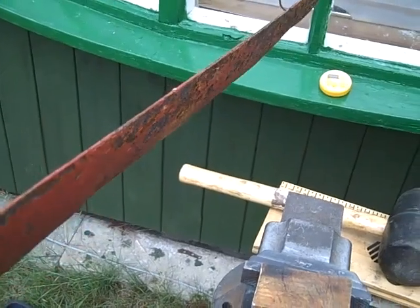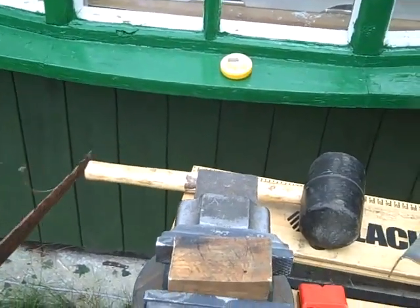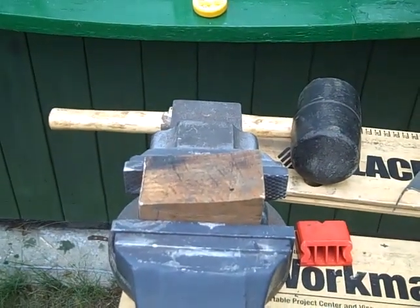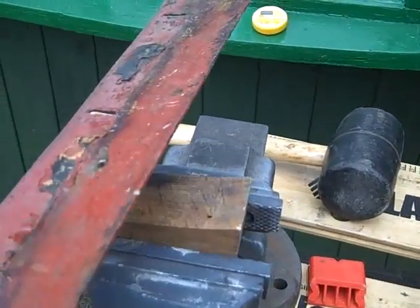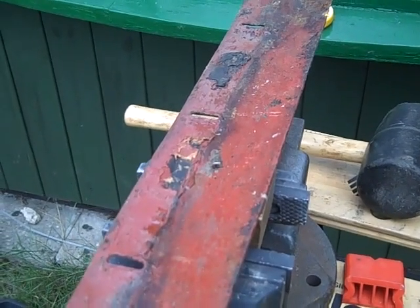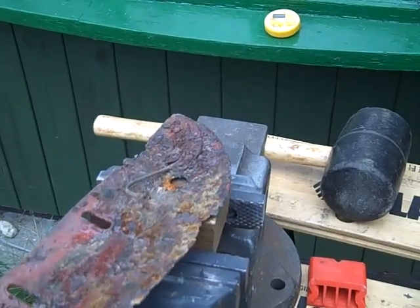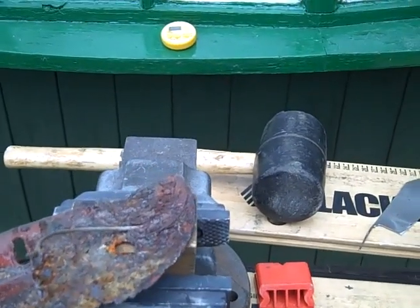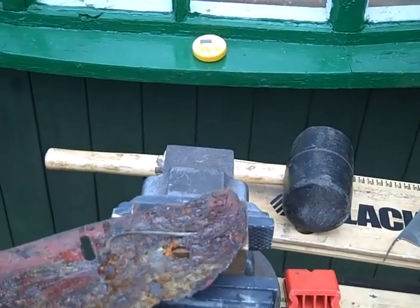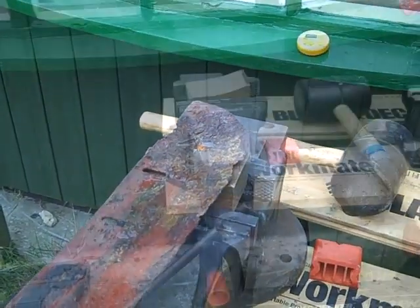To make the curve that we've got on this piece onto the new flat piece, we've got a bit of oak that we're going to shape into the same profile, so that when we put it on and hammer it we should get near the profile. We're going to work our way around. We know at the corner it's going to be difficult because there'll be more metal than we actually need, and we may have to splice the corner, but let's see how we get on.